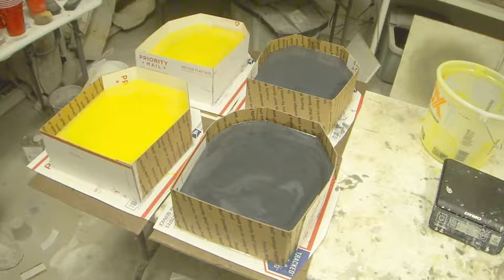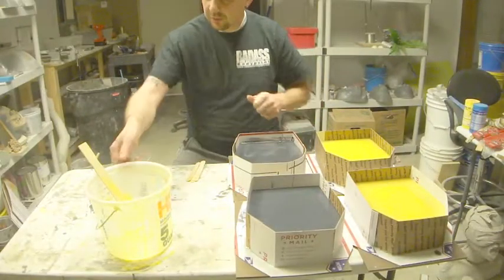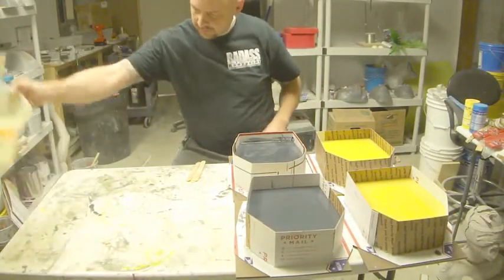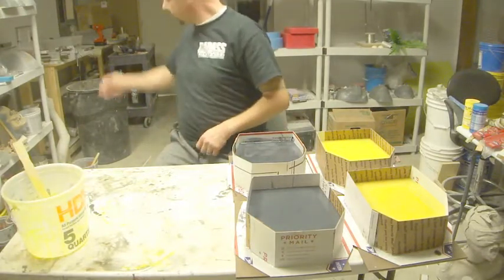It'll take, I think it's 12 hours for, no sorry, it's 4 hours for Dragon Skin, it's 12 hours for the Mold Max. So it'll be 12 hours, so I guess I'll come back and we'll demold them later on. See you guys later. We're back, these are all set, and you can pull them open now.